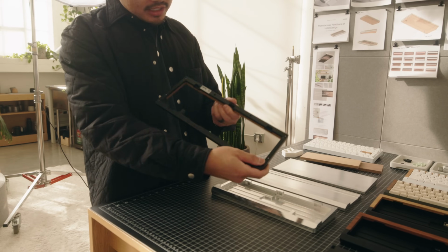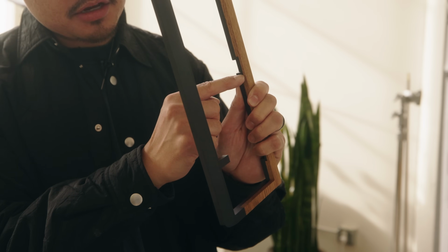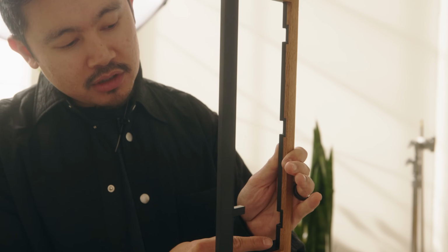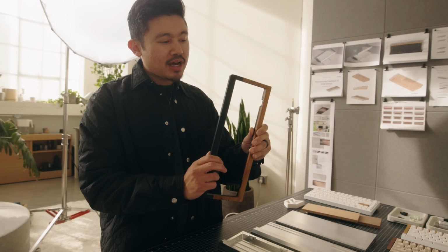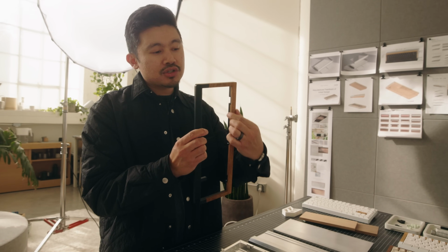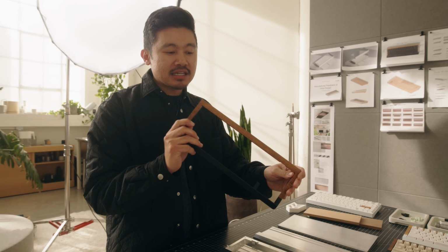it makes the product a little bit more special in the end. You can see in this area where the mounting blocks go, this protrudes out into this. You see how there's that block that protrudes into the wood? Yeah. So we intentionally created all of these right angles to reinforce the wood from wobbling around. With wood, because it's an organic material, when it's exposed to different climates, it shrinks and expands. But if you have these hard aluminum walls, it's not really going to shift. So we designed that intentionally so we won't have all of a sudden boards where the top has slid over 2 millimeters, right? That's definitely by design to hold that in place.